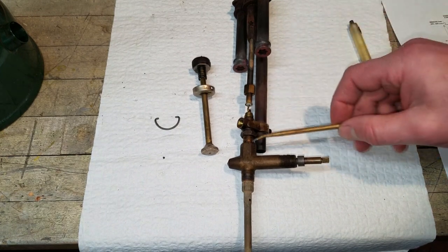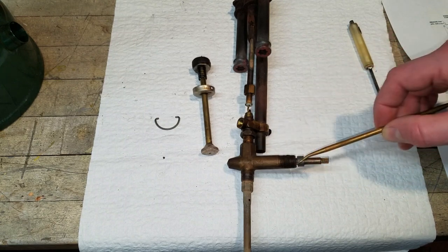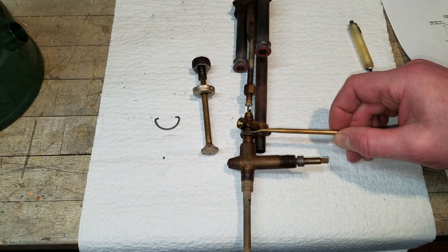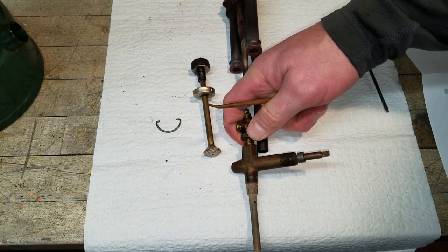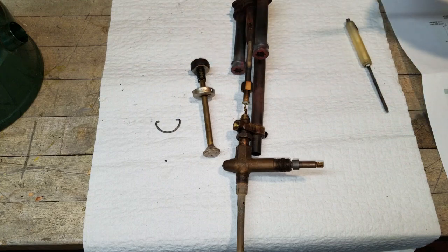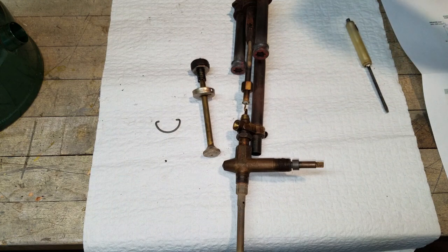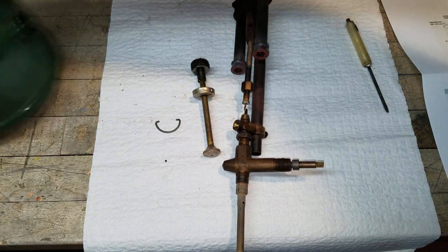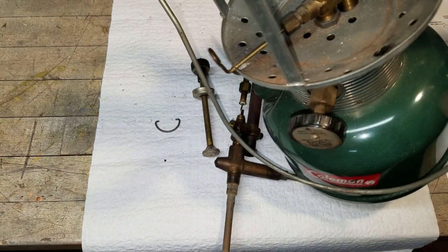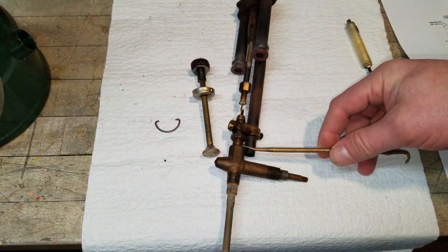Anyways, where this valve assembly or body threads into the actual valve here for the control valve also requires a sealant. This nut right here is a jam nut that tightens down. It's jammed up to the lower frame piece for the globe, the little metal part right down here. That's the same jam nut basically. So that is not a seal. That just pinches that in between here and here.